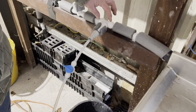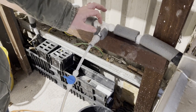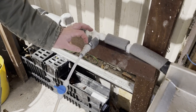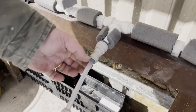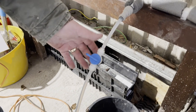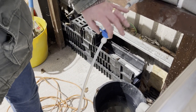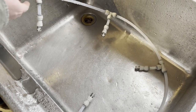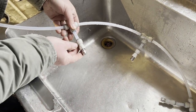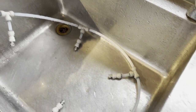I wondered why I'd put this little T-piece in, but I'm glad I did, because we've got a useful test point there. So we're 15mm speed fit into a 15mm John Guest coupler, 3/8 on the output, through basically what's beer line I'm using for now. Little isolator so we can knock it off and on, and then if you follow the pipe down, you'll see we've got these assembled jets ready to go. So I'll just stick the water on and we'll show you what we've got.